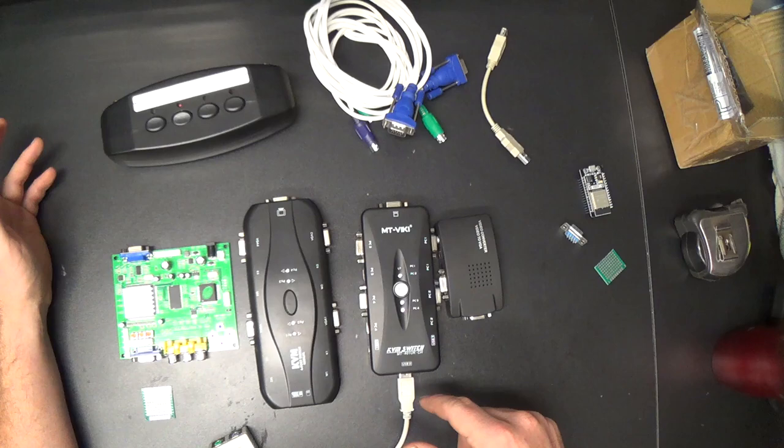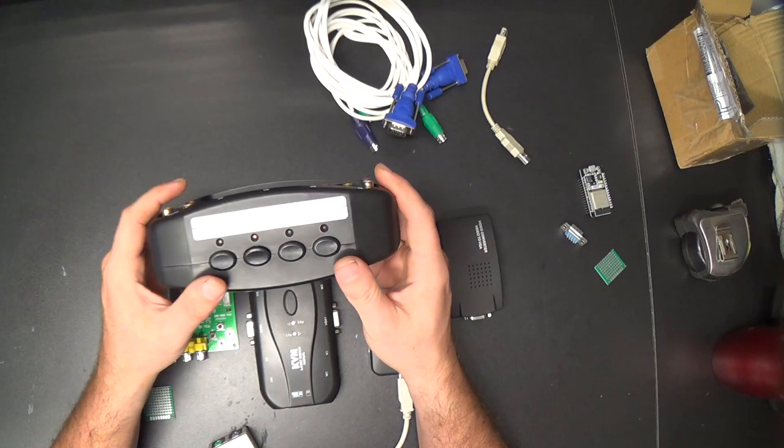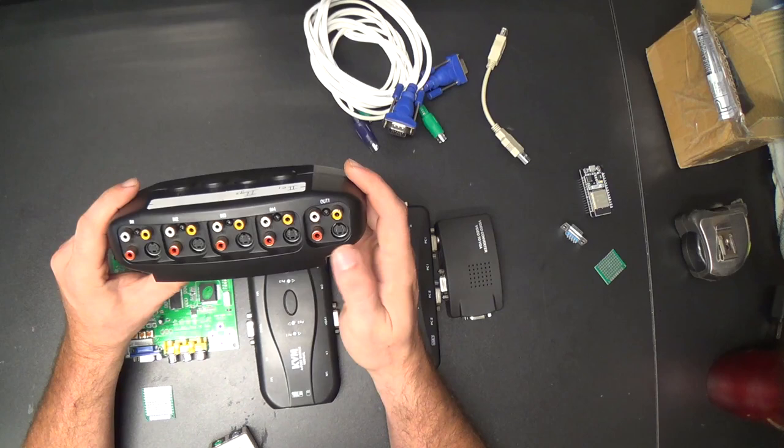But then we can also use that in the opposite way to connect all of this to the Mac and the IIgs. And this is a video switch box that I had been using to switch just the keyboard and the mouse between the IIgs and the IIci, because it handles S-video switching as well, and the ADB keyboards and mice just happen to use exactly the same connector as S-video. Now,